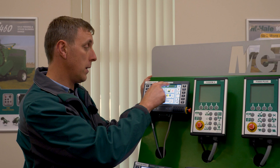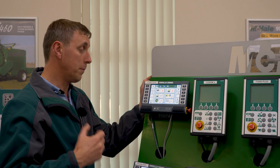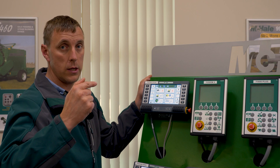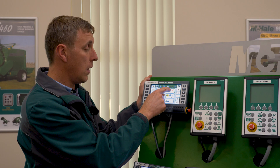Going through the menu structure on the machine itself, you can see here it brings up a menu across the top of the screen. The first option is your baler setup. The first option here is auto tip — you can turn that on and off so it will tip the bale automatically when the next bale in the chamber is full.